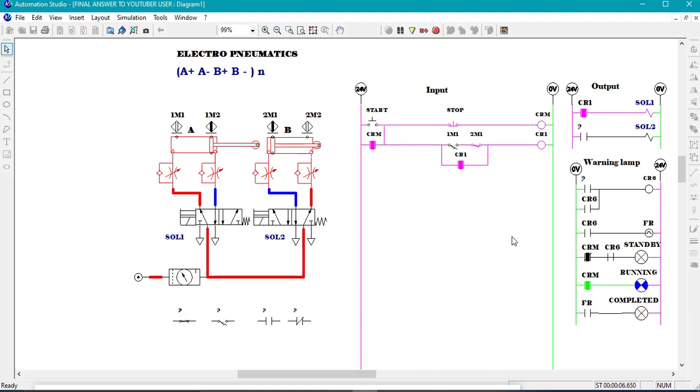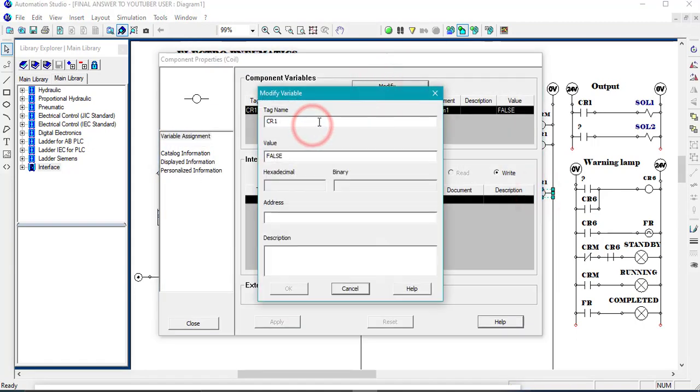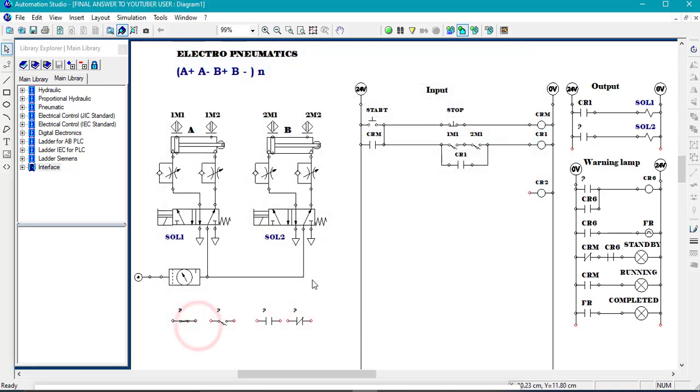So what we want next is A negative. In order to have A negative, we're just going to break here. This is the information to break there — 1M2, since the piston is here. So 1M2 is going to be used to break here. We're going to use another line. I take another coil and I'm going to call it Sierra two. Sierra two will need information from 1M2. I'm going to call it 1M2 here, then link the two. It will need a self-holding, and I'm going to call it Sierra two. Then Sierra two will be connected here.